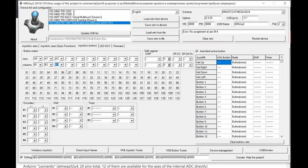The button lights up red when pulled to zero voltage and gray when at 5V (not pressed). For shift registers instead of button matrix, you select the chip type — 74HC165 or 4021 — and specify how many chips. For example four chips in a daisy chain. Then assign chip select (e.g., C6), serial data/MISO (e.g., A1), and configure the serial clock pin.